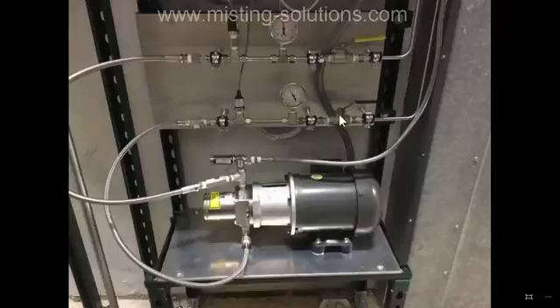Here is a ball valve that is normally open all the time and is used to isolate the system during repair. So if you'd just gotten done repairing the system, this ball valve would be closed, and so would this one on the discharge line going out to the valves and the nozzles. You want to close that to make sure water from that side of the system does not bleed out onto the floor while you're servicing it. So both of these would be closed during service.